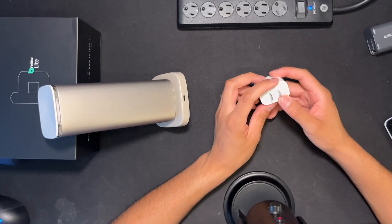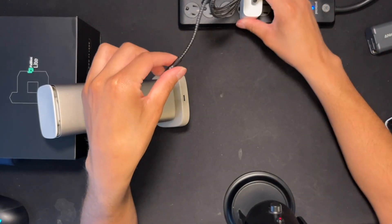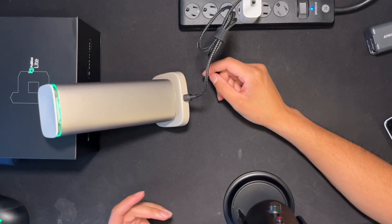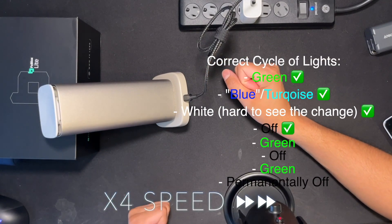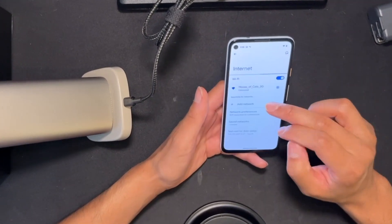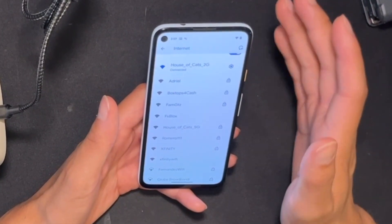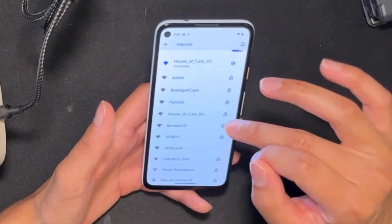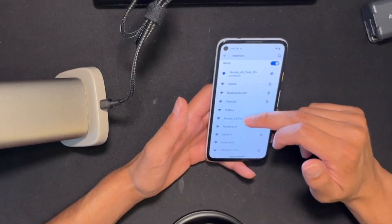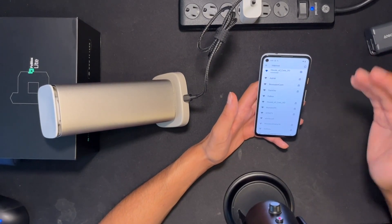Next up we have everyone's favorite iPhone/iPad charger. It does say USB PD on here. After a quick Google search, I saw that iPhone chargers are 20 watts, so I have a little faith this will work. We can verify it's working properly if we see the Function Blocks hotspot in our settings. It looks like iPhone and iPad chargers will work — but it just disconnected. It's turning on and turning off, which might be because of the lower wattage rating not supplying enough power to the blocks. So I think we're going to have to skip this one as well.